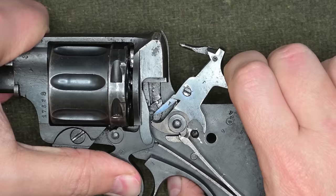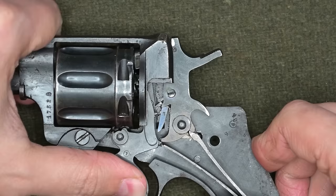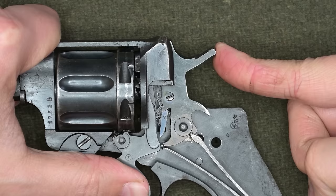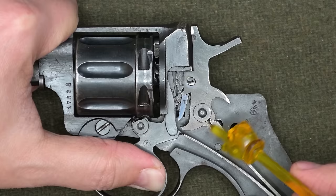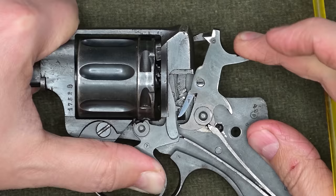Now, the hammer is an auto-rebounding type, so if I hold that trigger back and I push the hammer forward, that's actually where it would strike the firing pin, or where the firing pin would strike the primer. And then if I release it, you can tell it has a little bit of bias. That's created by a second little arm off the top of the mainspring, some complicated geometry, laying it on a shelf on the underside of the hammer, wants it to bias back. So when she falls, inertia carries her in, and then she goes on and pops on back.